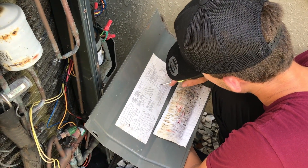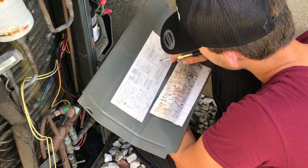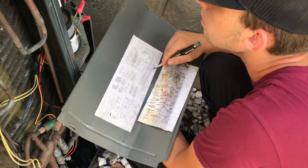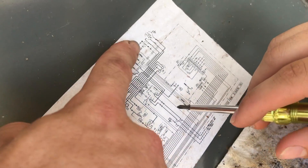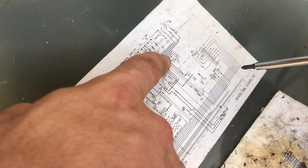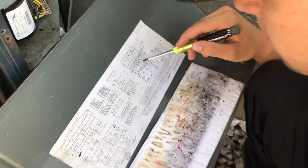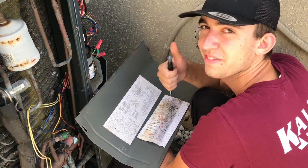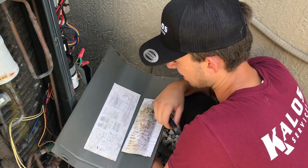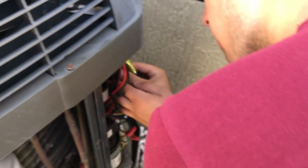When there's been a motor replacement or compressor replacement, your wire colors aren't going to be the same, but they're always going to go to the same motor. Here's your compressor, here's your fan, and the colors coming off of that down to your capacitor — where's that wire being connected to, what color is that? Looks good. Let's go ahead and put this cover on — helps keep the ants out, and it's just a little safer when the power's off.